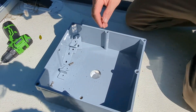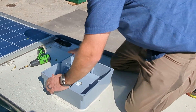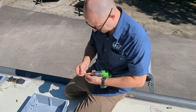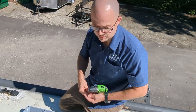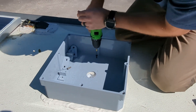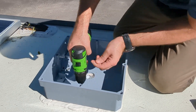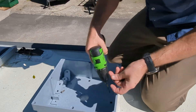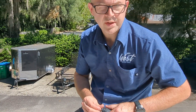There we go — that's going to solidify and dry up. The screws are really designed just to keep it secure to the roof. Don't overthink the screws because the magic is in the glue, not the screws. Go down just tight enough so it holds — don't overtighten or they'll strip out. I'm going to let this dry and then we're ready to put our antennas and router on.